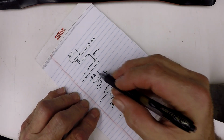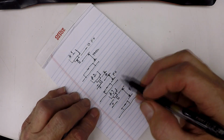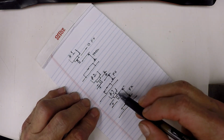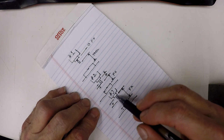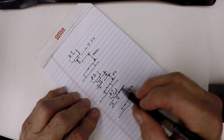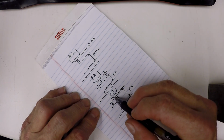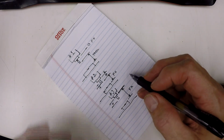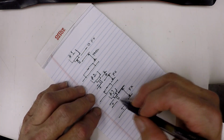Now number 2 and number 3 are basically identical, except that you have a reference tool instead of just setting it at the face of the spindle, or this would normally be considered the gauge line of the taper in reality, but the face of the spindle works out to be pretty much the same, and you can actually just use the face of the spindle to set this.